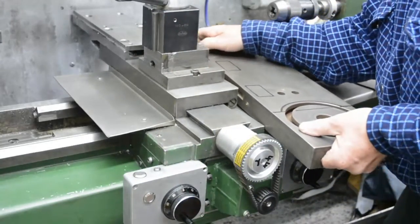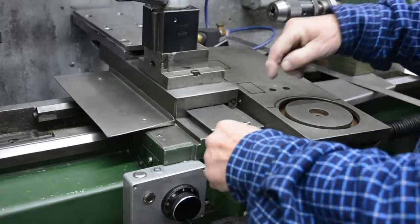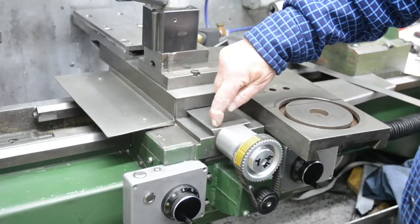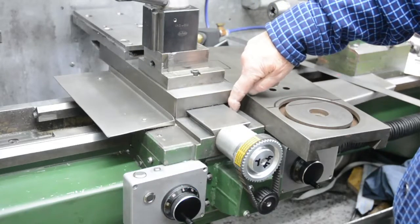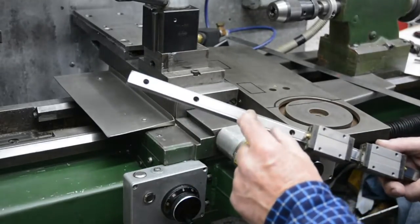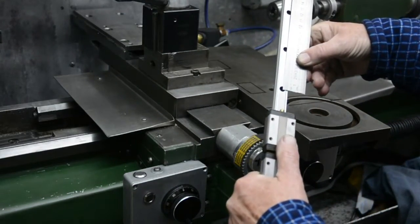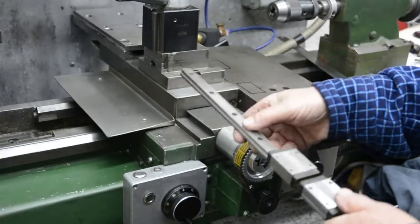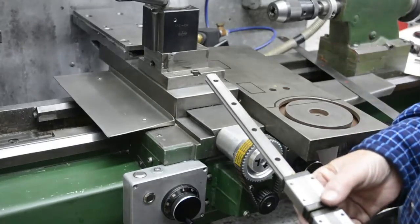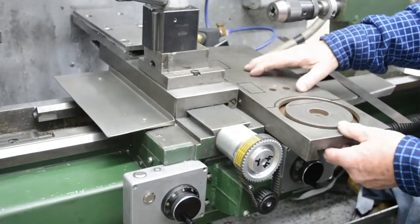So that's it — it's all pretty simple. I get rid of the existing slide. I keep the ball screw. I take this top off, which is like a flat piece to sit on a mill, and I can mill away on here. Two cuts on these surfaces. And then, as you can see here, the slides have mounting holes every 60mm, so they're held down quite rigidly. I need to get these true to one another and true to the axis of rotation of the spindle — none of that's difficult, just a little bit time consuming. And then replace this top slide with another top slide.